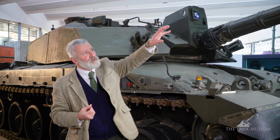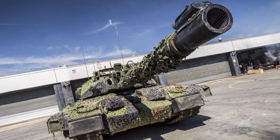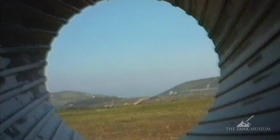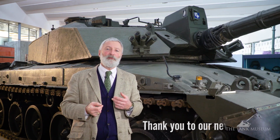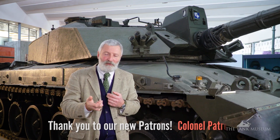So again, we've mentioned the fact this gun is lasting longer in service, because now with this gun, they're actually chroming the barrels. One of the things we don't often talk about is obviously when a round goes down that rifled barrel, it is tremendously abrasive as it's going down the barrel. So it wears away very, very quickly. By chroming the barrel, you're extending barrel life. So it'll go on a lot longer. And again, these things all come into play when we talked earlier about cost, because you don't want to be replacing a very, very expensive barrel too often.